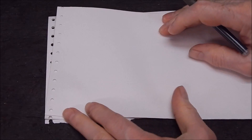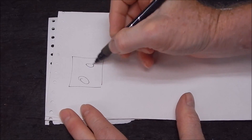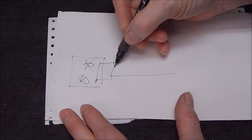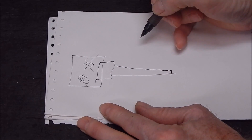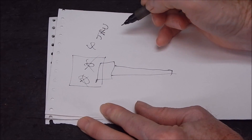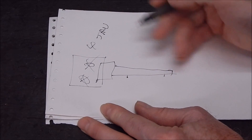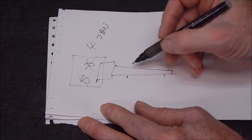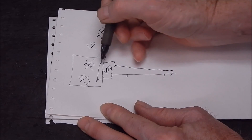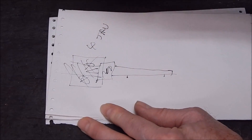The basics are: you put your taper body in the chuck here - this is the one you want to reduce. You do this in a four-jaw chuck. You then measure off against the taper there and there to make sure you've got no twist at all so that it is concentric, because there's no guarantee it will be concentric. But the taper will be relative to your live centre point. This could be a drill or whatever you're turning down.